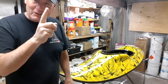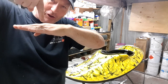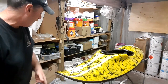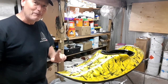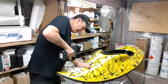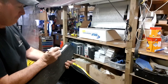I don't want to go side to side because I might break the edge of the 50 millimeter foam. So imagine I've got my piece of foam and I drill down to make a slight chamber. When I pour resin into it, it'll make a barb-shaped plug encasing the rope tie-down in it. It's very important that I don't go side to side because if I do, I could break it and end up with gel coat or flow coat flowing all over the inside of the boat — that has happened to me once, fortunately on my own boat. I know I'm in the center of the pillar because I've got those little X marks there, and I'm only going to go down to around about two inches.